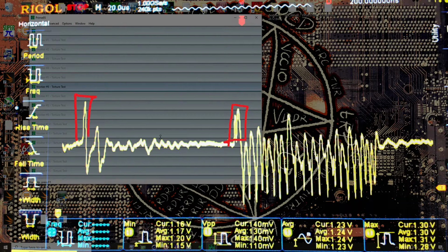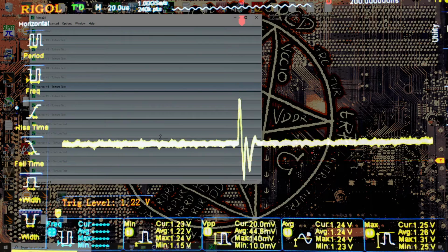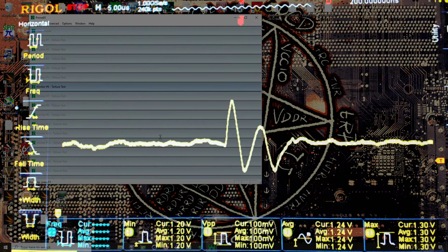And also here we can see something also getting in the way of Prime 95 running. Here we have some kind of relatively steady load. And then here, I think that's the processing of the mouse input that's going on over there. Though it is worth noting that this VRM with the LLC completely maxed out also just kind of doesn't... Oops, wrong mouse. So this right here is very clearly the load release overshoot, because Prime 95 gets interrupted by the Windows interrupt. What I'm not entirely certain about is why we get two downward spikes.